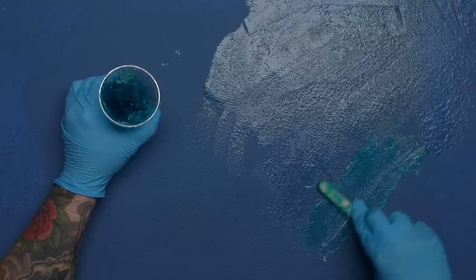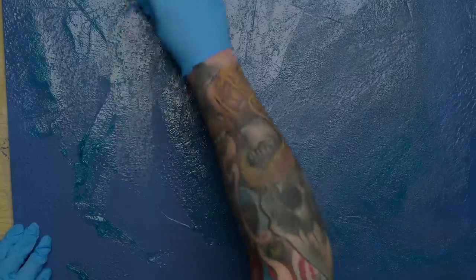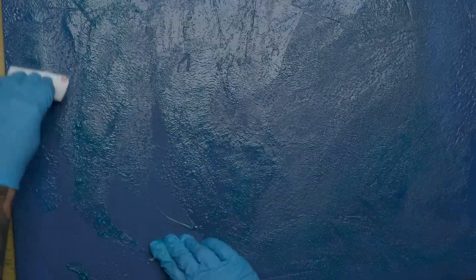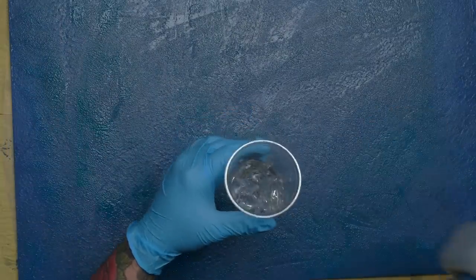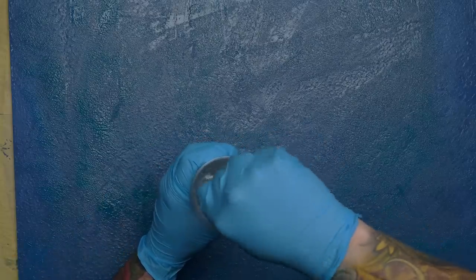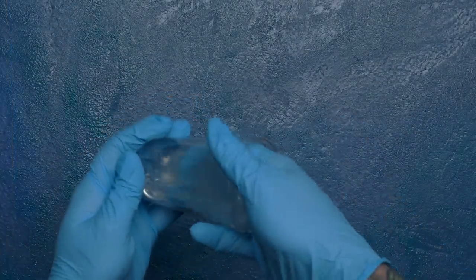I spread it out as best I could, but it was a nightmare. It was so sticky — I even kept breaking tongue depressors trying to spread it out. Also, this stuff had one of the strongest eye-burning alcohol smells I've ever encountered with silicone. It had that 'your house is going to explode if there is a single spark' type off-gassing that required a ton of ventilation. Because of the strong alcohol odor, I thought maybe I could use isopropyl alcohol to thin it out. That didn't work — all it did was make the silicone less sticky and create a sort of slime putty.